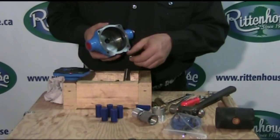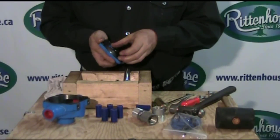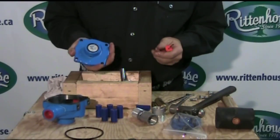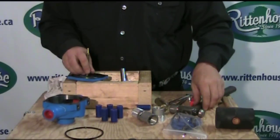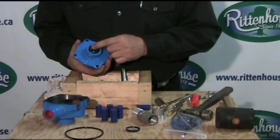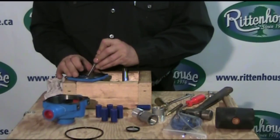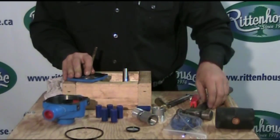We checked this and it's fine, so we're good to go. The back plate is good. Now we're going to finish taking all the parts off and strip it right down to its basic self. Take out the O-ring. You'll notice the cap on the back — we have to get rid of that so we can take the seals out. Get a small piece of brass and your trusty hammer again and pop it out. Now you'll see a bearing here; we have to get rid of that because the seals are in behind it. We take a punch and put it down through the hole.